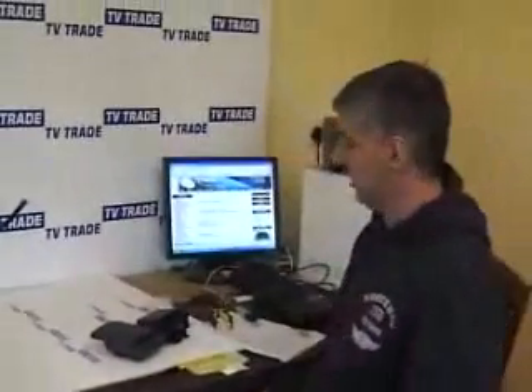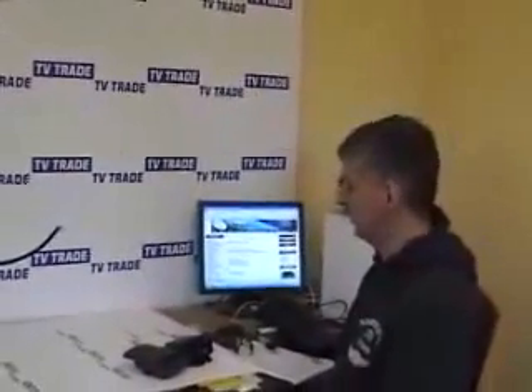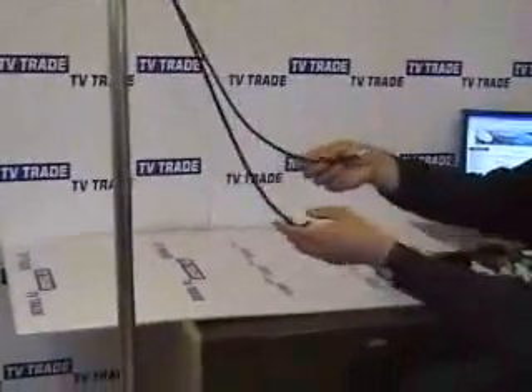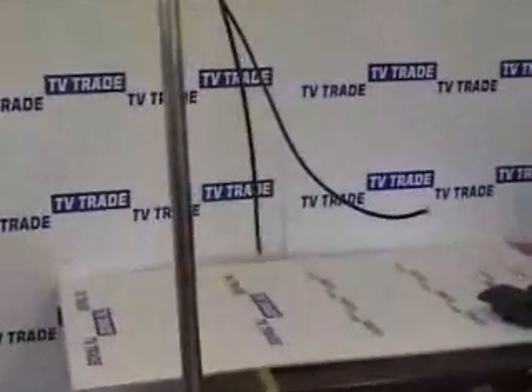I want to discuss the issue of how to install a UHF diplexer. The purpose of this particular product is to combine a UHF and a VHF aerial into a single feed. Common in Ireland and some other European countries, some channels are broadcast from certain transmitters on VHF and other channels are broadcast on UHF. So it might be necessary to mount both aerials on a single pole, such as we've done here, and we have two cables feeding down — the first cable is the UHF and the second one is the VHF. So how to join these into a single feed?